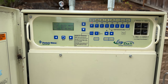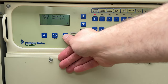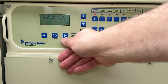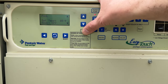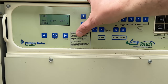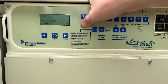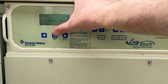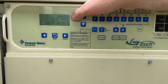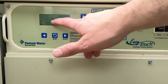The other basic feature you should know about is heat. If you want to control your pool or spa temperature and you have a heater, go to heat and click pool. The temperature is set to 90 — that's too warm for a pool usually, so let's say 85. Hit select. I can choose between solar, solar preferred, or heater — I have a natural gas heater. If I want the heater to reach 85 degrees I'll hit select.